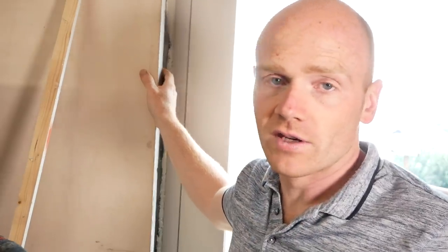There are a few reservations with using an expanding gun grade foam. One is you can really distort your frames. You don't think it's gonna happen, but foam when it expands is pretty powerful stuff. And even on a plastic window, you can get it deformed. So especially with this one, I went really careful with that. You can get a low expansion foam, which is probably the much better route to go. This stuff was just standard expanding foam.